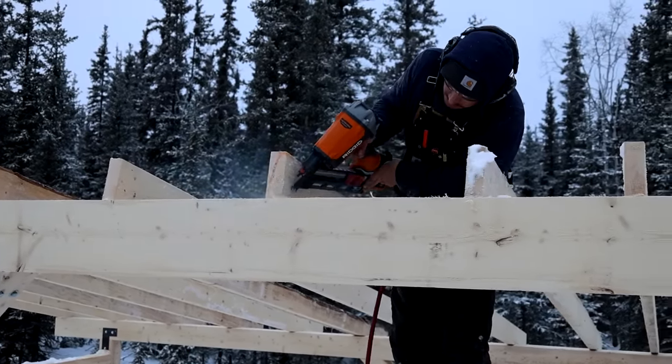And since these are just kind of hanging out here on the front, we need some support to support all the wood we're gonna put on here and the metal roof. So we've got a pretty cool design of a truss that goes back. This one's actually built out of a 2x4 also, and it's gonna connect this rafter back into those rafters. And as you can tell, when I push down on it, it is just extremely solid. As soon as we get this all up, the last step on this project is gonna be metal roofing.